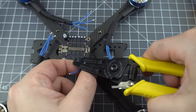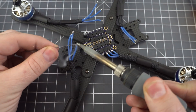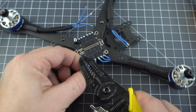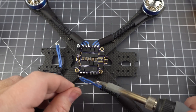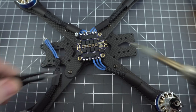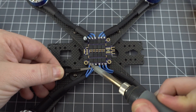Here's how I solder my wires — it's a pretty straightforward process. Basically I just cut each one to length as I go, tin each wire as I go, and push them right onto the balls of solder that I pre-applied. There might be some mistakes here and there but that's nothing a little flux can't fix. If your solders don't look quite right or you start getting a pointy bit when you pull your iron away, just apply a little flux and that'll smooth it right out — it'll give you a nice shiny ball of solder. This is probably the most time-consuming process of the whole build, so once you've got this down, the rest is smooth sailing.